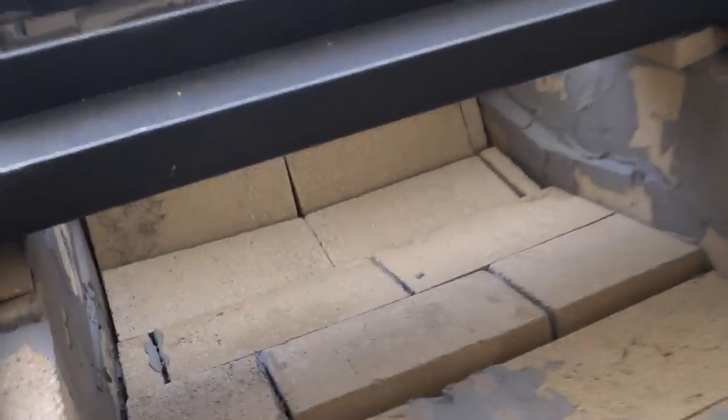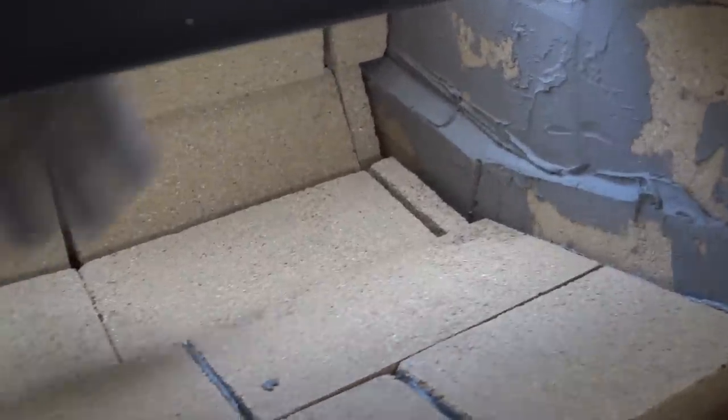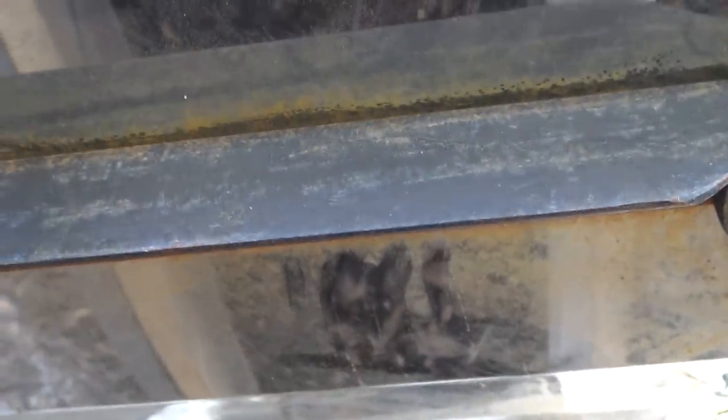Back up with fresh batteries — it's another day now and it's bricked all the way to the back. I want to go over all the gaps and do my finish coat. I already did it on the arch and it looks real nice, so I want to make sure the sides look as good as the arch by doing a skim coat. One important thing to remember: when you're under the flue or chimney, you do not want to mortar those bricks. If water comes into your chimney you want it to go through the cracks, and there are a couple of drain holes along the bottom so any water drains out.